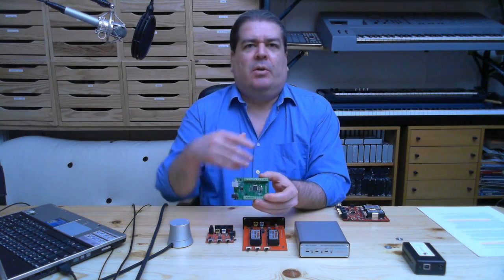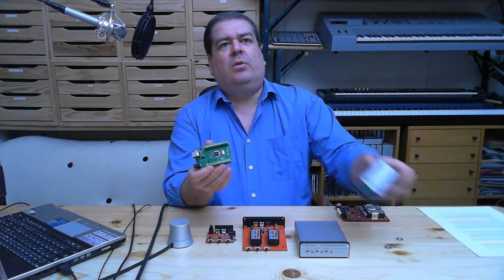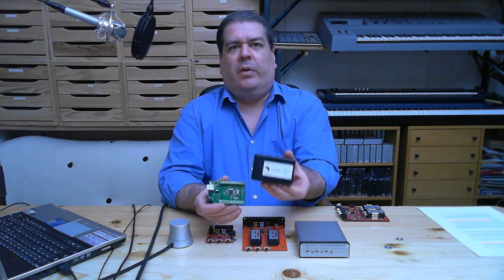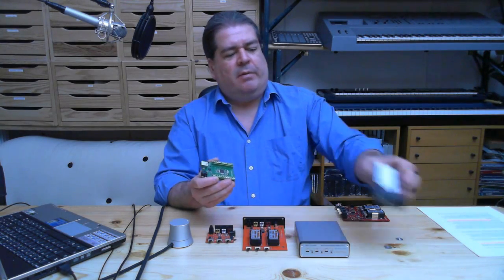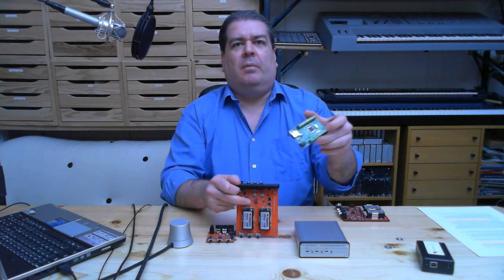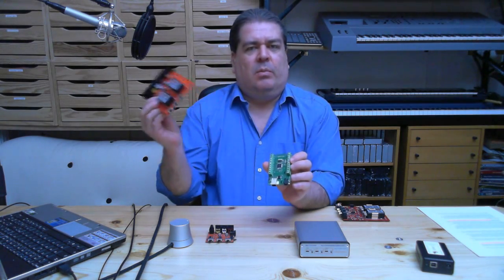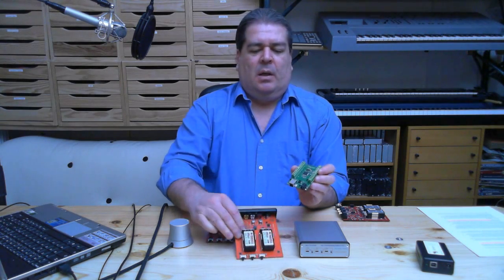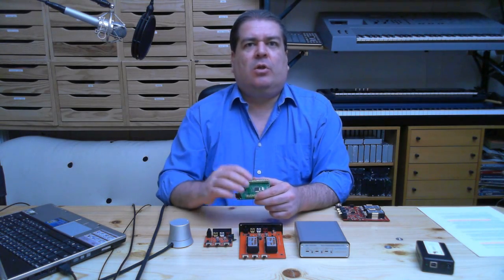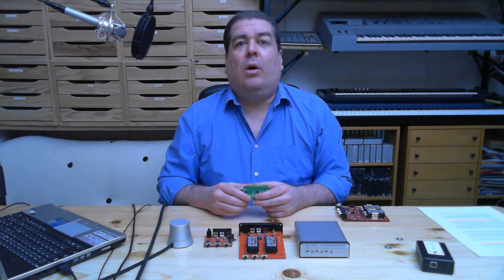It supports robotics, sensors, smart buildings — you can connect different things to the screw terminals here. It comes in two versions: a board version for OEM operation and a laboratory version, which has been used in many universities as a general-purpose I/O device. The idea was to merge this microcontroller that handles the USB protocol with the analog subsystem of the DAC — the S/PDIF receiver and DAC chip. But something else needed to be added: a great clock source, because USB is known to be a bit choppy and not such a great clock for audio DACs.